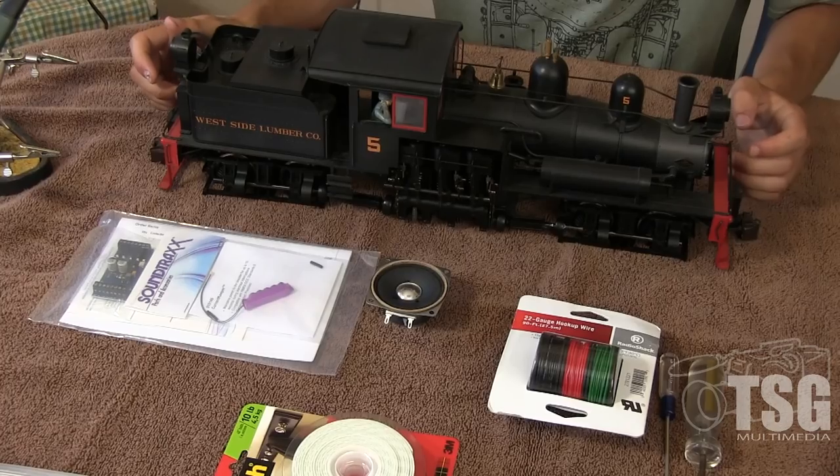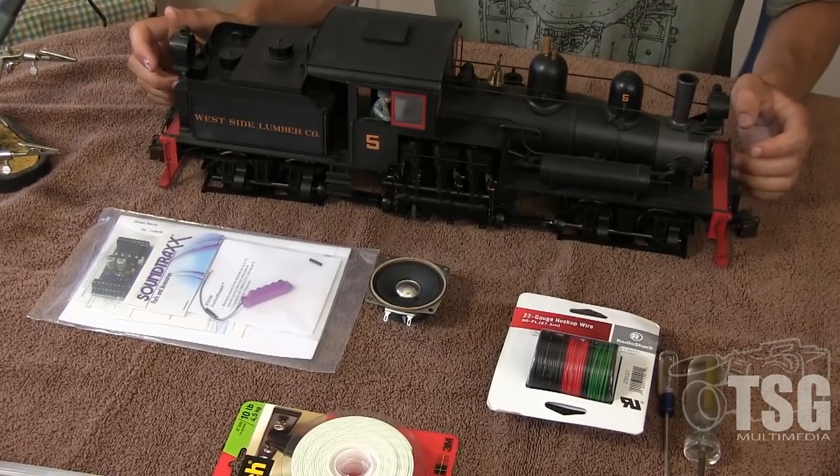And as a matter of fact, some of the older engines, maybe this vintage, I've never actually had a 38-ton specifically apart. I've had the 36-ton and the 3-truck Shay apart, which are the two sister engines to this one. But the older engines, like the 36-ton, for instance, there's no color coding whatsoever in the engine. It's all black wires. So I had to have the whole engine apart and track all the wires with the voltmeter to figure out what was going on in there. So hopefully this one's not like that. That'll make the conversion a bit of a pain in the you-know-what. It'll be a little easier if it's coded, yeah? If it's got any color coding of any sort, it'll be nice.